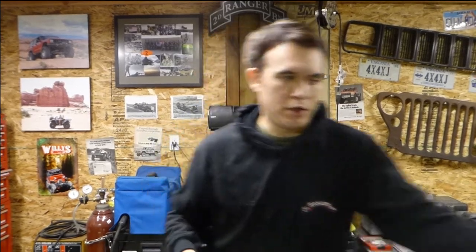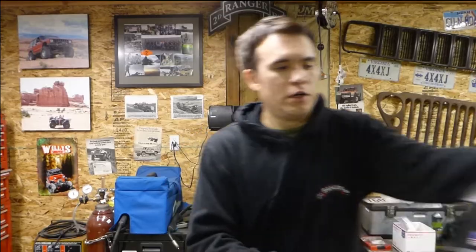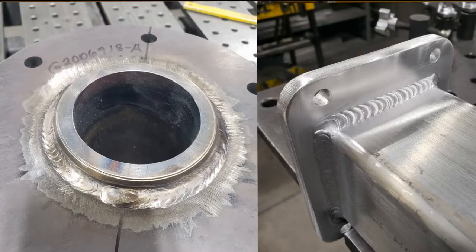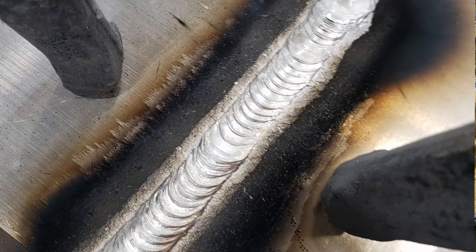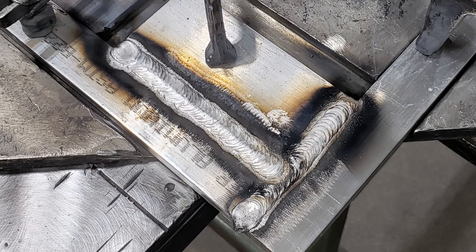Each of the hoods I'm showing you today I've used for at least 2 years, with the exception being the entry level Miller. And under those 2 years, I've done primarily MIG and TIG welding, steel, stainless, and aluminum. As far as MIG aluminum, that's with running a push-pull gun. Pretty dirty process, but it's better than a spool gun, I will say.